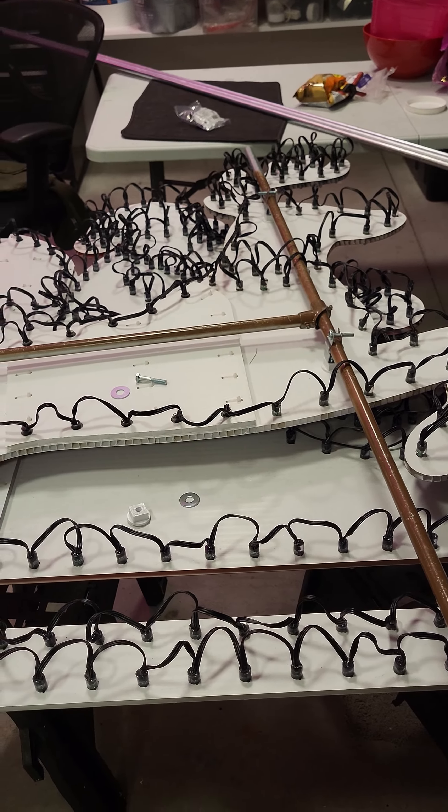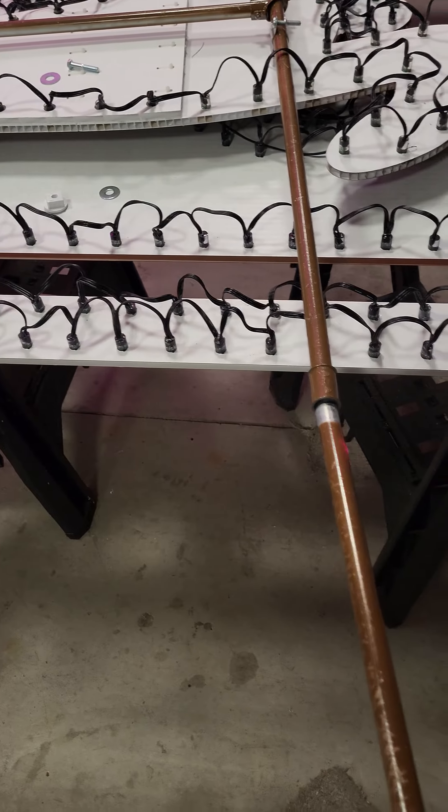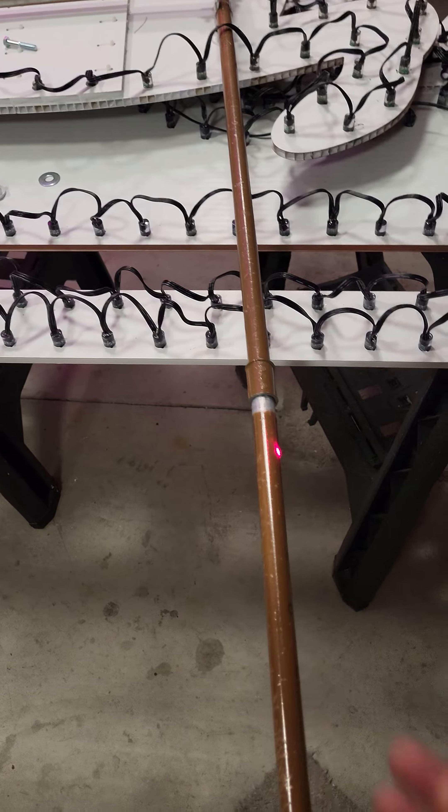Stick one of these standoffs on the bolt and put a nut in the EMT hanger, clamp them together, then paint them quickly so if any part is sticking out, it's not as easily seen. But that is how I do it.